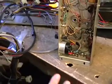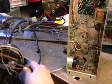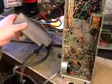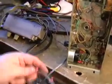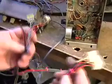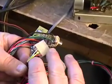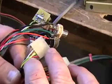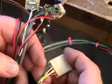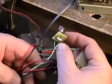And remember, if you buy one of our harnesses, our remanufactured harnesses, or one of our new harnesses, it's going to look a little differently. This is what it looks like, and it's a far cry from the original, but you'll see that there's a yellow and a green wire in this spot, and that yellow wire is going to a braid, and that green wire is going to the LED, and so is the white wire. The white wire is positive.